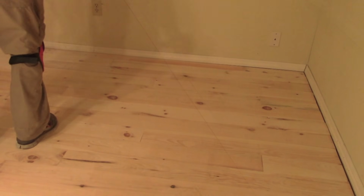This is obviously going on a lot thicker, and it's giving a nice look. Now I want to be careful that I stop on a seam if I do stop, so it doesn't look like I have an overlap. But I'm going to have to be very diligent about putting it on the same thickness through the entire space, and being very, very careful. You can see to the edge here, I kind of feathered it out and we ran through our paint that was in there, but I think this foam applicator is fantastic.